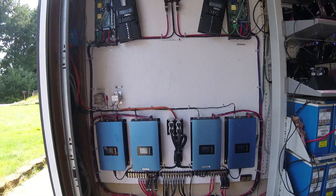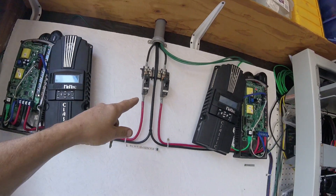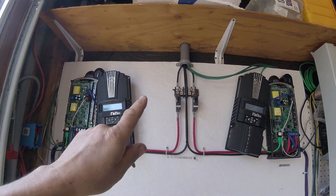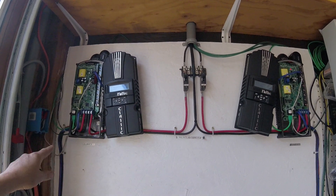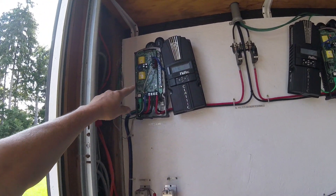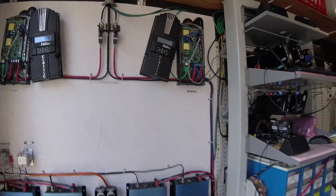Down in the garage, an inch-and-a-quarter conduit comes down and goes through a 100-amp breaker for each line. Each 100-amp breaker is five strings, so ten panels. Line one — all my stickers are coming off, unfortunately — goes to a Midnight Solar, charges the battery. Line two, Midnight Solar, charges the batteries.